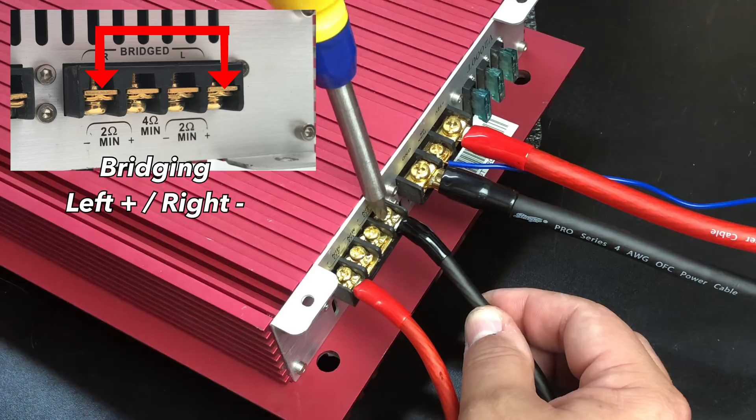Now let's check out what's inside this amp. We'll take out the trusty screwdriver — check the link in the video description. As expected, the VU meters are hooked up via wires to the amp, so it was difficult to get the top panel out of the way, but you can see the internals. Not a bad looking amp from 2002. There's a big TriPath chip, and the version on the amp reads '2000 watt Class T, Rev 1.0, V2000T.' We have 3,300 microfarad 25-volt caps, and 50-volt 1,000 microfarad 105-degree Celsius caps — which we like. The TriPath chip is what actually drives the output.